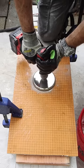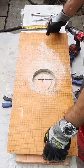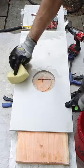That's a critical step because when you drill out the hole, the water is going to cool the bit and reduce the chipping, and it's going to give you some terrific results.